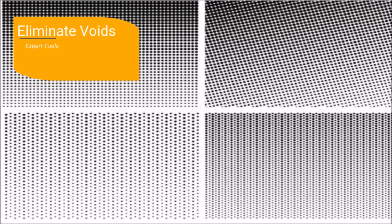Our overlay of a dot matrix pattern to your artwork enables air to be vented through the face of your die utilizing a series of stamped dots, creating a network of fine graphics versus one solid area. This technique is achieved utilizing various dot sizes and spacing to best accommodate each application.